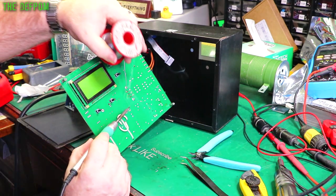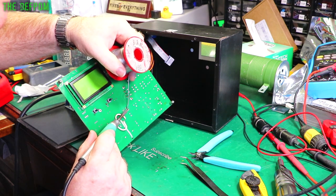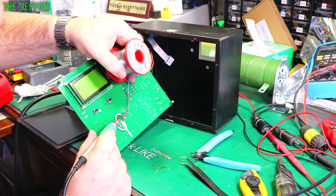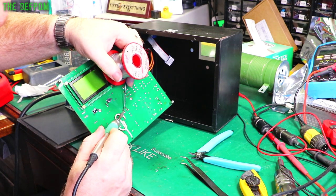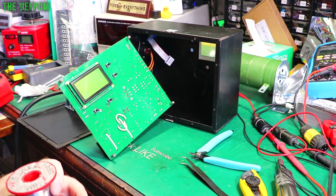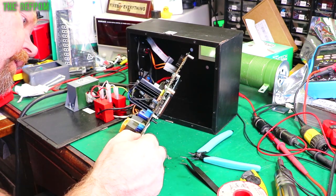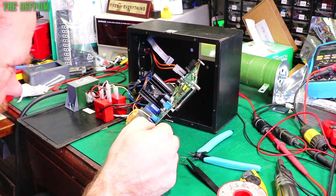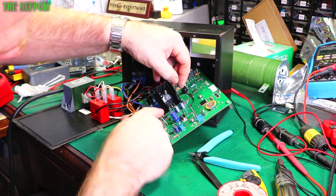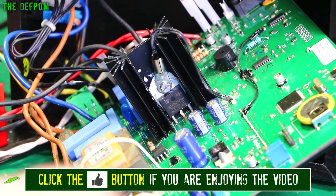Let's do the IC. I know you can't see this particularly well but I'm trying to get a wider view. I'm going to try and get the flow through the board to get to the other side as well, because it does have tracks on the other side. I don't need quite as much effort into these ones because there's much less thermal mass here. Let's see how the other side looks - see if it's flowed through. The IC looks fine. The Triac, same as before - the middle leg didn't go quite so well. So I'm going to re-solder from this side as well, just to tidy it up.